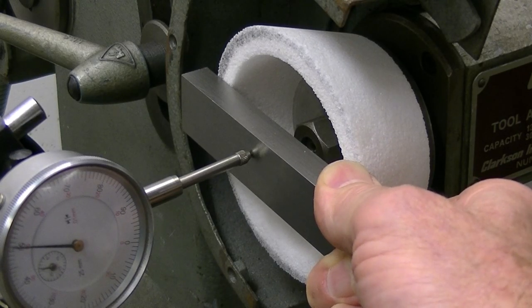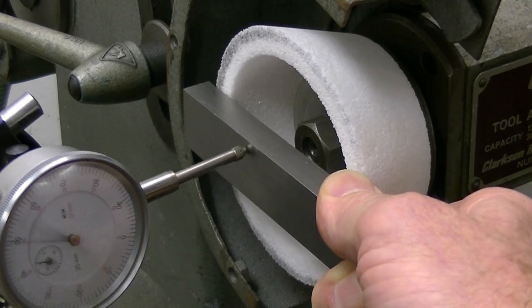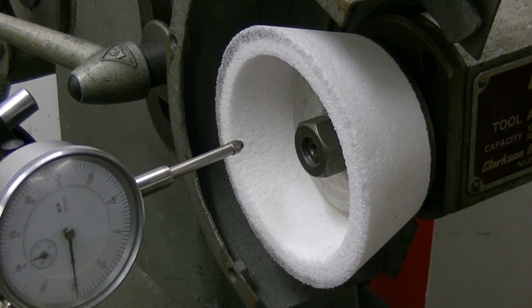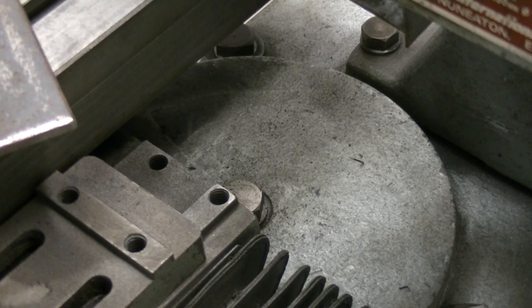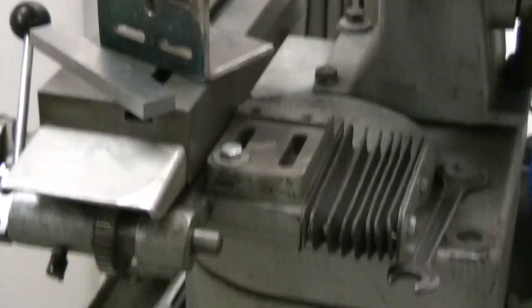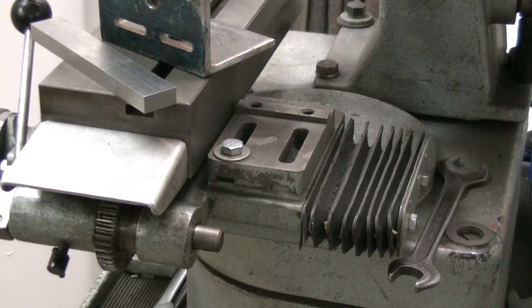Here I am indicating in the table to the wheel — I'll show you the pivot point later on. It's simply tilting the table from side to side until I get a reading close to zero along there. It's very close at the moment and would do for the work, but I might try and get it a little better. I'm using a handmade parallel held across the front of the wheel. The reason I have to do that is the Clarkson table mechanism sits on a sub-plate that pivots around a bolt, and of all stupid things, the factory didn't put dowel pin holes at the 90-degree increments, so you've got to clock it in every time to get it correct. The sub-plate at the bottom is what pivots — this is the lower table — and the upper table is the chicken swivel. I'm clocking that in using the dial indicator to get the table movement parallel with the outer face of the wheel.